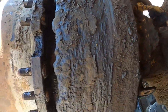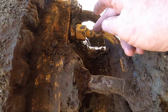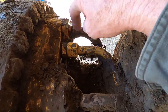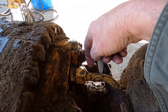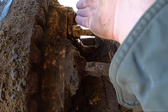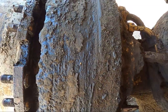Normally, so I can pull this wheel hub apart without draining the tank, I use these two cooling lines here — and this brake line, which gives pressure to the piston when you hit the brakes. What I do is pull the clamps off, pull one bolt out, loosen the other bolts, stick a bar in there to push the two lines out of the way a little bit, and slide one of these lollipops in. Then I tighten it all back down and do that to both cooling lines. That blocks it all off so the only oil you lose is what's in the brake assembly itself.